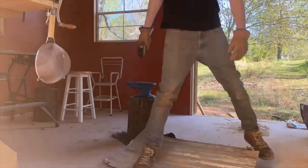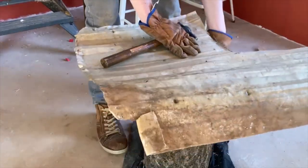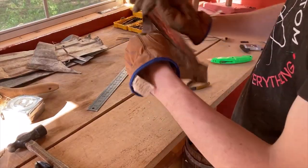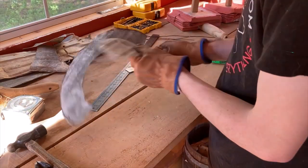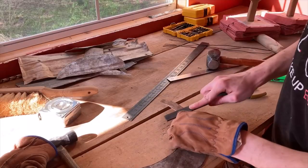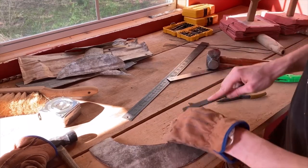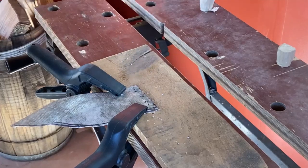Aluminum may not be perfect for this application due to its very low melting point, but I continued to work with it anyway. It is very reflective in IR, which means it should resist being heated radiatively, and its high thermal conductivity should spread the heat that does reach it around evenly. Its melting point would be a problem if it weren't for my intention to only use the chimney intermittently, as running the furnace continuously with the chimney would be wildly inefficient. The chimney creates a column of hot air; as the hot air moves up the column, it creates a displacement — a little like raising the plunger in a doctor's syringe. This displacement sucks more air into the furnace, which invigorates the flame. The taller the chimney, the larger the displacement. This increased airflow increases the burn rate and raises the temperature of the fire higher than it would naturally be. In the case of charcoal, it can be a lot higher.